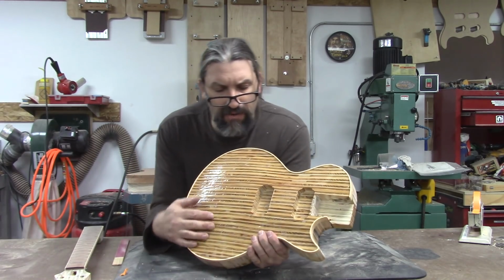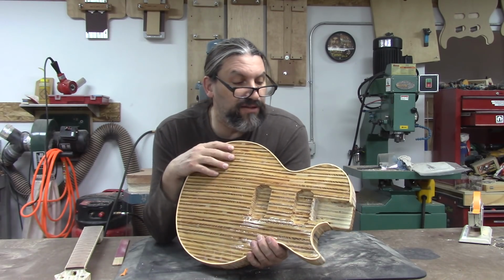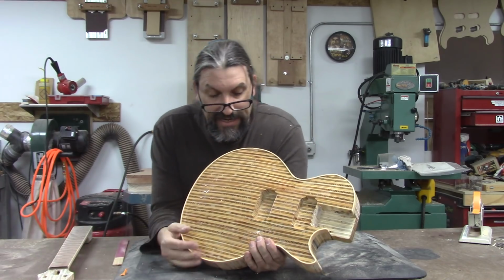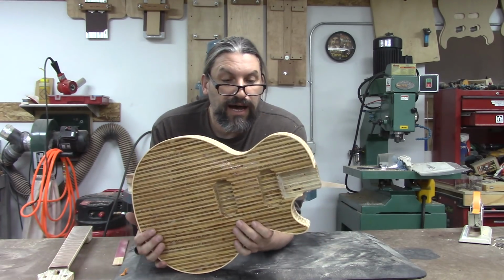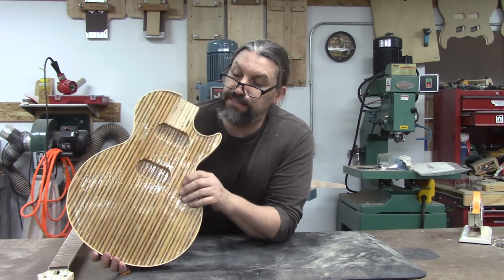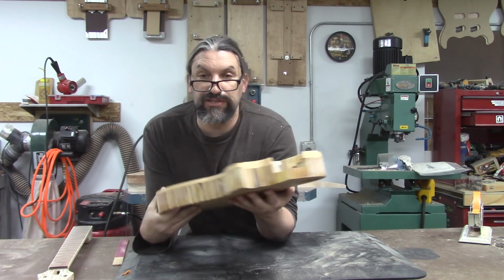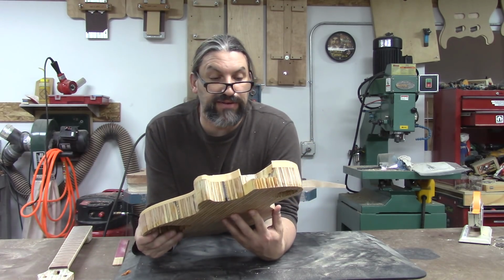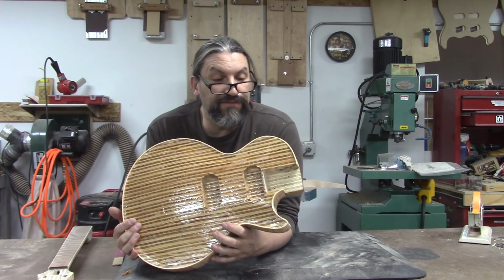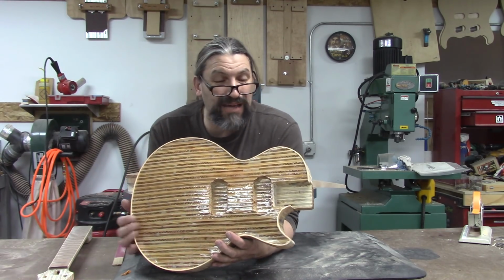In the next video, I'm going to sand the top and get the binding level, and we'll get the neck set and get it in for sealer as well. You know, binding a Les Paul can be tricky, and there's a lot of ways to do it. The acetone in the syringe trick is a pretty good one, and I would advise you guys to consider using that.